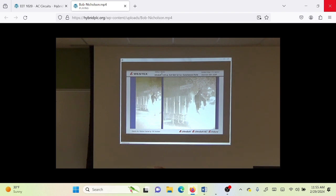Now, this is exactly what they do at a steel mill, except there are three carbon electrodes that are 18 inches across and 30 foot tall. They bring them down into a big pot of ground-up steel, and they short it out deliberately. And it starts melting, and it melts anything that's there. It's 36,000 degrees. It's going to melt the steel, and eventually they pull a chute, and there's your liquid steel. So this is what a steel mill looks like, except this is not a steel mill, this is a person